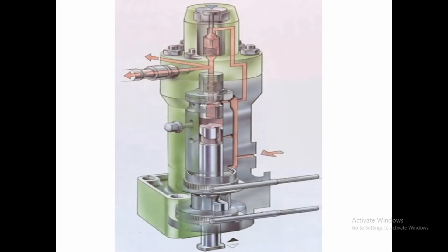Let's consider the detailed description of a fuel pump and its parts. The barrel is fitted inside the fuel pump; it works as a casing of the plunger. The plunger reciprocates in the barrel located in the pump body. The helix is machined on the plunger. When the plunger is moved down, the spill ports on the barrel open and fuel flows into the barrel.